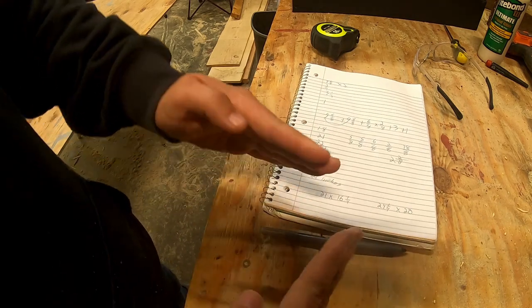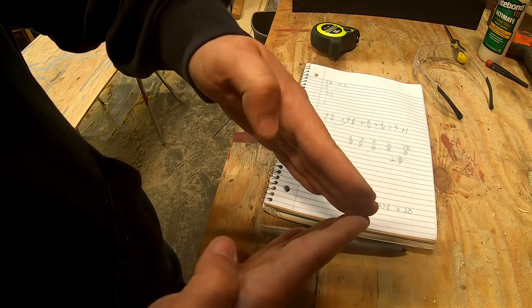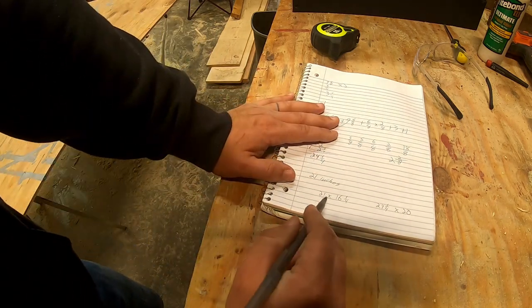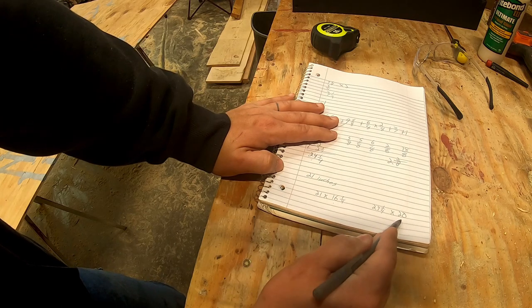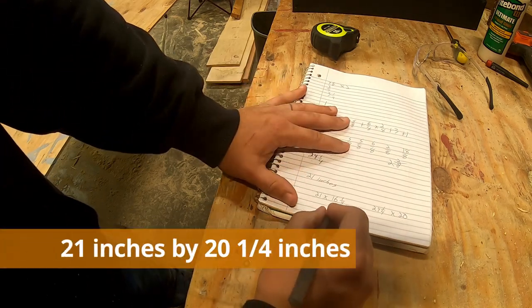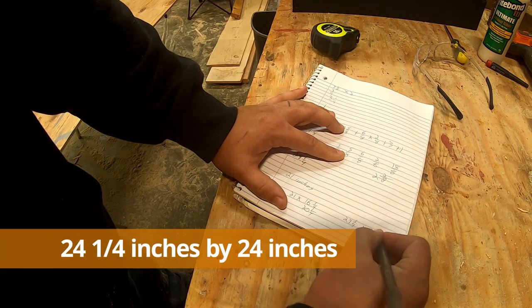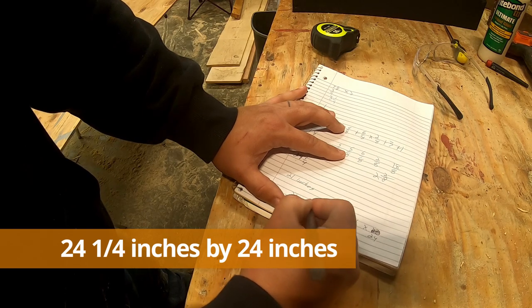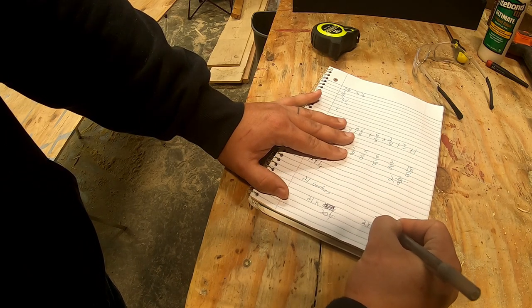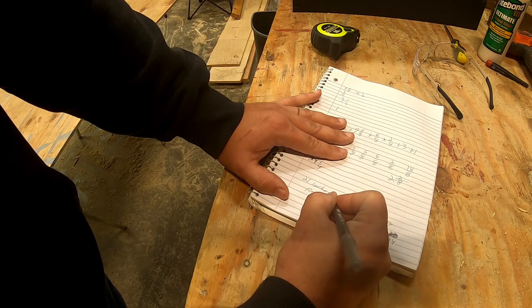So that's how we figured out our dimensions for our foam boards. Now, one thing I want to try to do instead of butting them up, I kind of want to do the whole picture frame thing where you've got a 45-degree angle in there. That way we could unfold them and fold them together and it'd be perfect. So what we're going to need to do is add four inches to each of these, so we've got an extra two inches on each side. This now converts to 20 and a quarter inches and 24 inches. So this will be the sides, this the front, and the back.